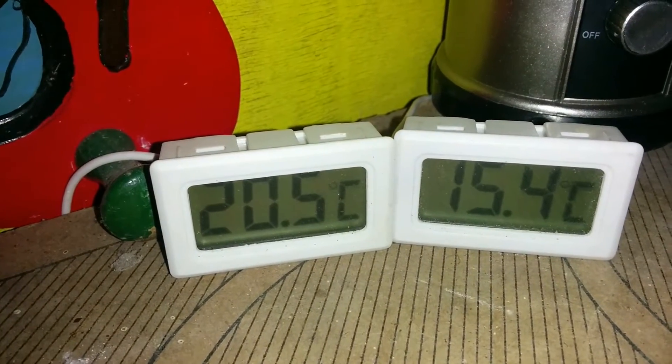The sensor is biased a bit because it's in reflected sunlight. The shed is not insulated — it's just one centimeter of wood going to the outside, the roof as well. All the walls are uninsulated, the windows are leaky — you can see light coming through — and the door is massively leaky. I can pass my fingers through here and there's a weird draft blowing inside. Above the heat pump itself there are gaps and the flap flutters in the breeze.